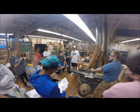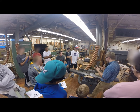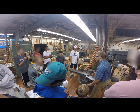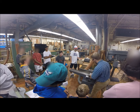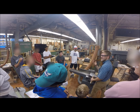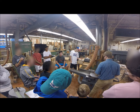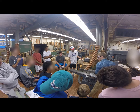Safety on this machine is very easy. Your fingers are never to go below the guard, and you're never to manually open the guard with your hands. The reason is if you were to slide your fingers across this tabletop past the outfeed table, you would have a sixteenth of an inch less of a finger. So if your fingers go below the guard while you're supporting your workpiece, you're going to lose them — just push it through.